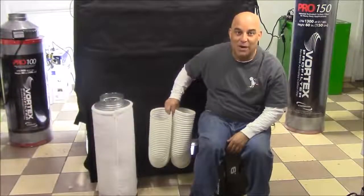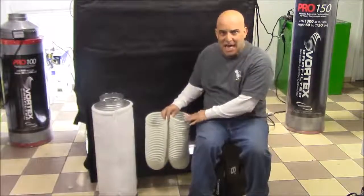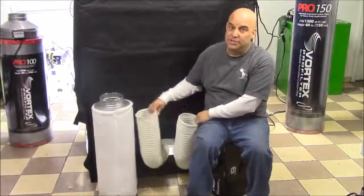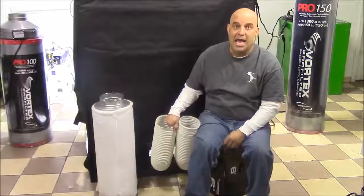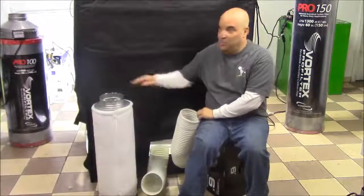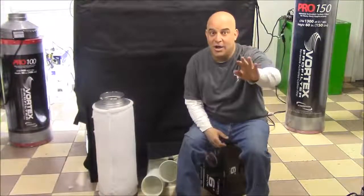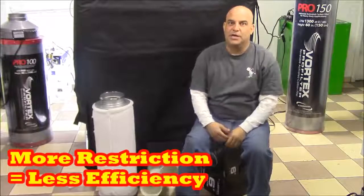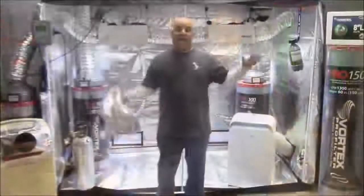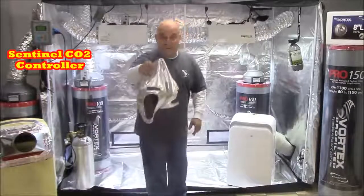It's always better to run these out a window than vent them into your house, even if you have to attach additional ducting and a booster fan to the exhaust side. The important thing is to make sure the air going through these two ducts doesn't dump into your house. Don't use the exhaust to vent your hoods or put a filter on it — not because it's going to ruin the filter, but because the more you restrict the exhaust side on the AC, the less efficient the AC operates. Now we're venting the lights and cooling the tent without exhausting the air we just paid to cool, or the CO2 we paid to add.